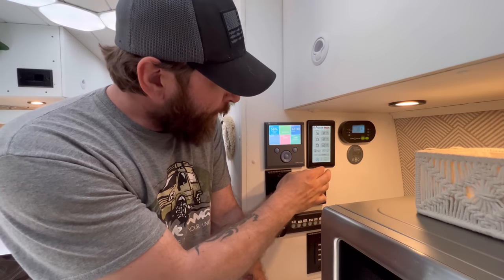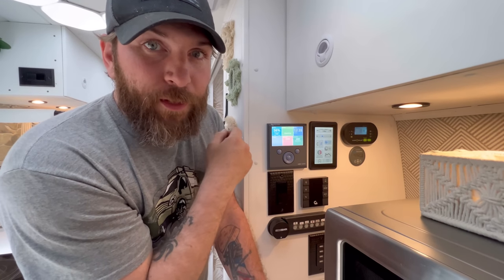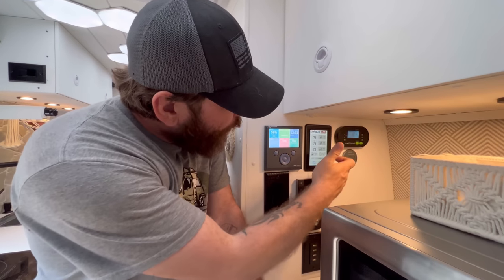You can go into the settings for all your diagnostic stuff, high-altitude mode, and interior heat priority for summer and winter modes. In summer mode it prioritizes water demand since you don't need interior heat — it's also a tankless hot water system, so it automatically starts heating water. In winter mode it prioritizes interior heating, which means you won't get that instant hot water.